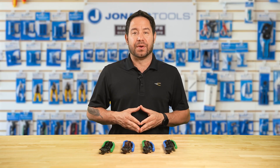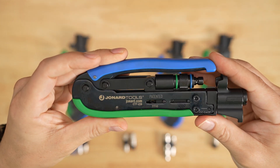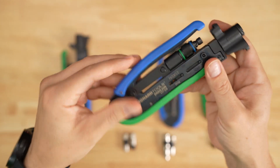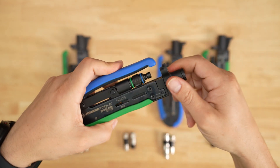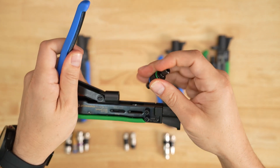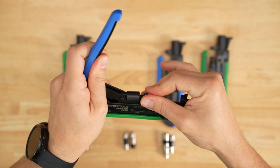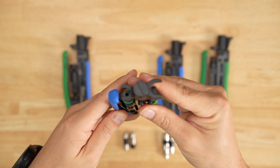As for the CTF 230, this tool is designed for use on both short and long-style F-connectors such as the PPC-EX-6 and the PPC-EX-6-XL connectors, as well as most F-connectors used for RG11 cables. The green side of the plunger is for short-style PPC-EX-6 connectors and the blue side is for long-style EX-6-XL connectors.